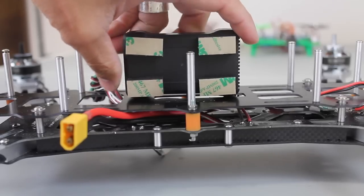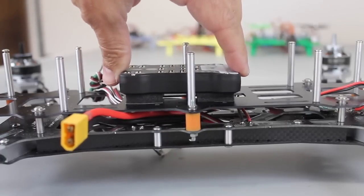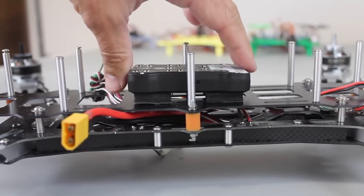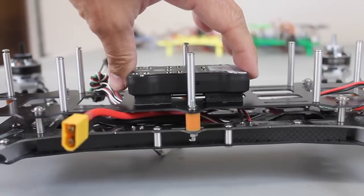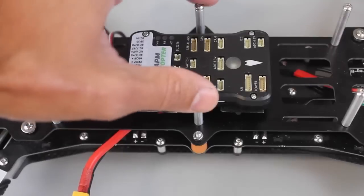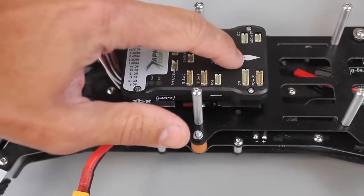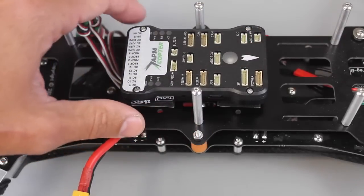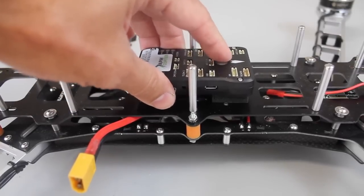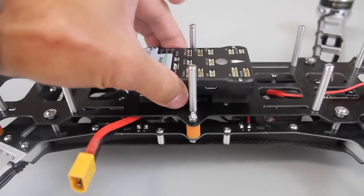Now let me point one thing out about these pads - they're 3M adhesive, double sided. And you'll notice that this foam is super spongy. These things work great. I know you pay a little bit extra for Pixhawk over the APM and others, but it really includes all the components you need to take the thought out of doing the install. These are the center posts of the QAV500, so I'm going to mount the Pixhawk dead center here. You'll see the arrow going forward - this is the front of our quad. Take care to make sure that you have this mounted pointed forward; I speak from experience - I've mounted it backwards before and it is a severe pain to get turned around.